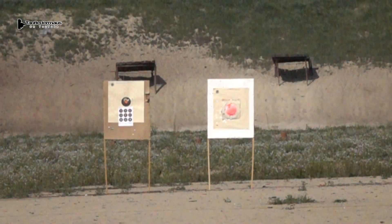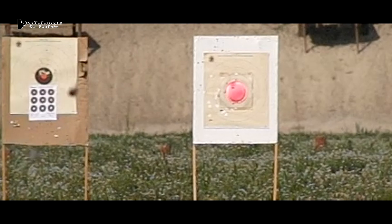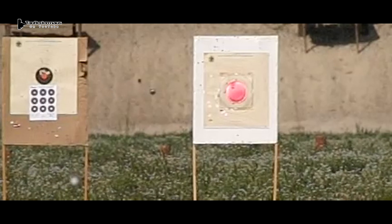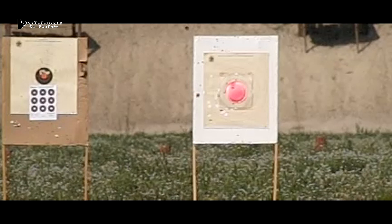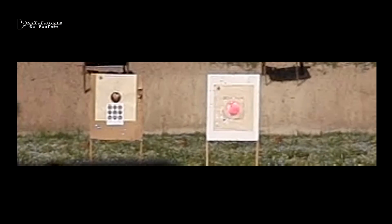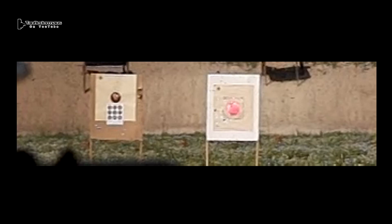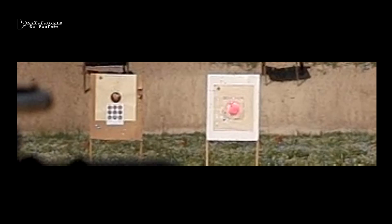What's interesting about this shot is you'll see the nitro card stuck to the back of the slug, and then bam, it's finally released. That's telling me we probably don't have airflow going through the center of the slug at all — the shock wave is pushing the air around the slug. That's definitely something important that we learned from this study.